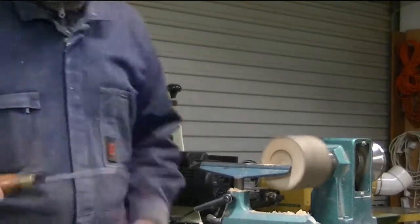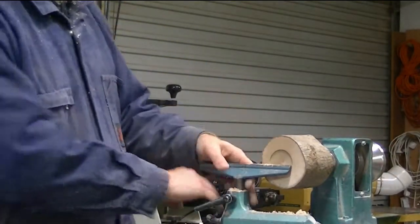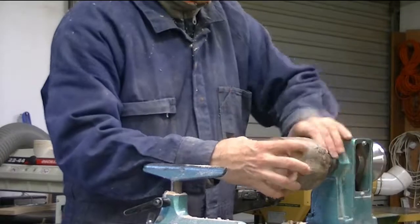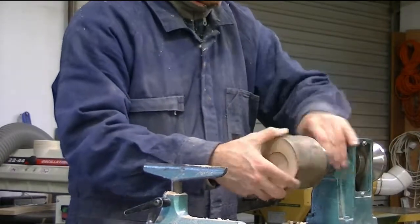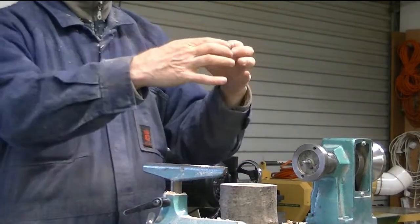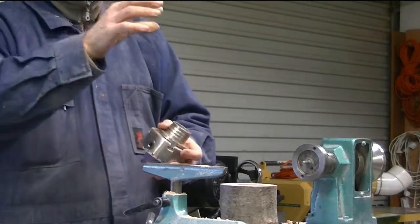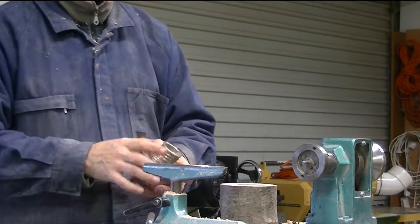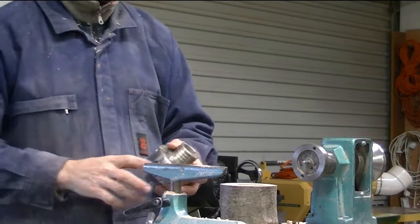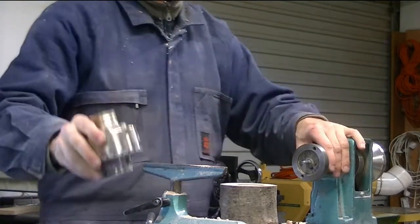This is probably as much a personal preference as anything, but I always like feet where you're gripping from the inside. The reason is that gripping from the outside, you have to get it pretty much exact. If it's exactly the circumference of the jaw when it sits in there, then you get no marking. Otherwise, even 4 mil off, you get noticeable 4-point marks where the jaws have closed in sideways on it. 8 marks, actually. Yeah, 4 sets of marks.